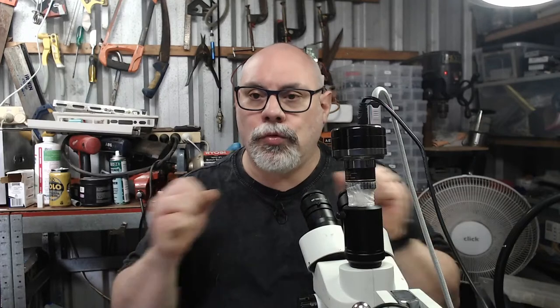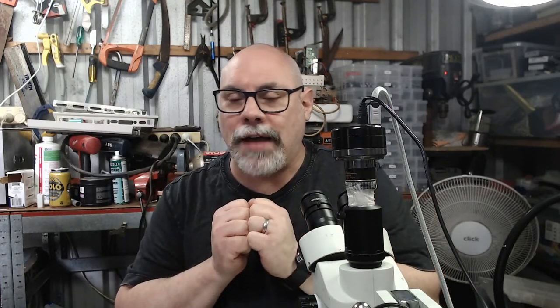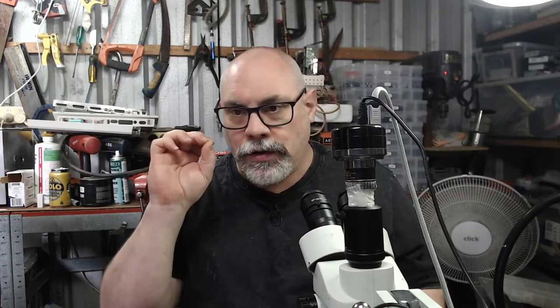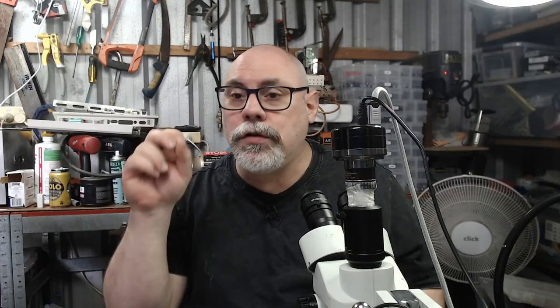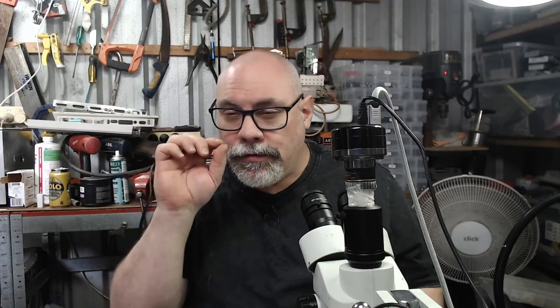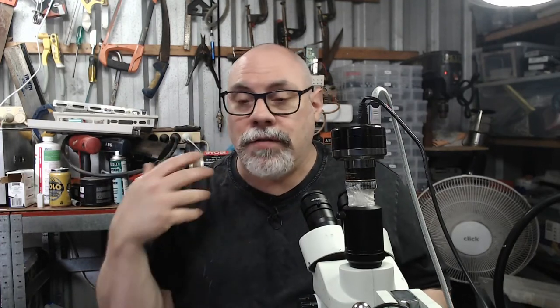When it travels through water, it actually creates little voids in the water. This is a process called cavitation. It makes these microscopic little bubbles that burst and let off a huge amount of heat and energy at that time. When they do that, they help clean very fine surfaces. They don't do damage. They're very delicate cleaners, but they're very effective.